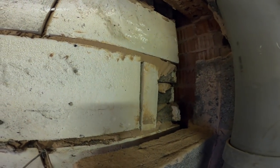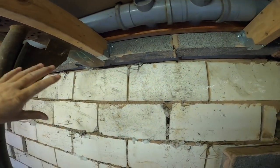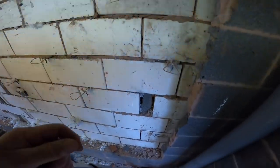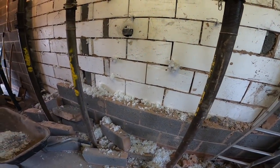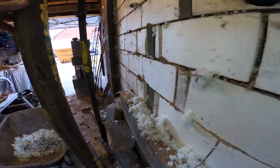And then this is the 350 pad stone, 450 seating of the lintel. So lintel steel, that can go in after dinner. Once we've got these two courses out of the way, drop these, clean them, get them away, and then we can slide the steel straight down there.